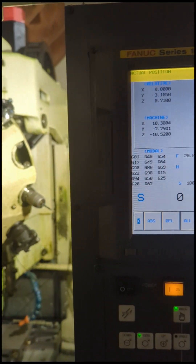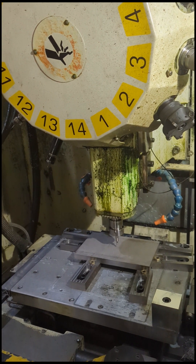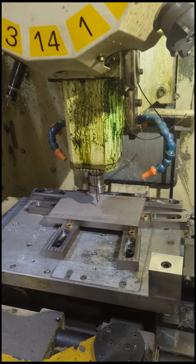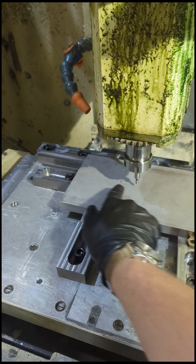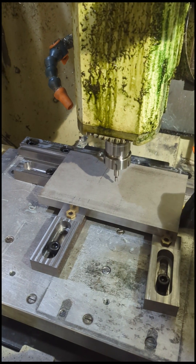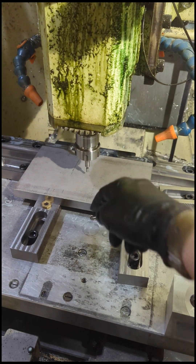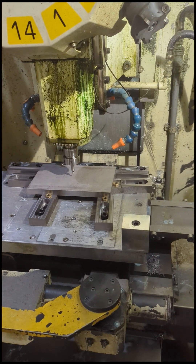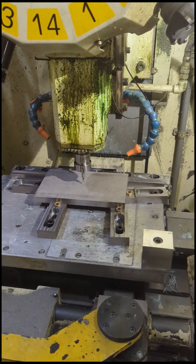I press reset, jog up in Z, and jog until the relative position says zero — it should be right at the middle of the plate. If you're wondering where those numbers came from for both X and Y: because I measured from edge to edge, the length of the plate, you have to add an extra 200 thou because the centerline of the wobbler was offset by 100 thou on either side — same thing with the Y axis. In the next video I'm going to show how to set your Z axis. Now that we have all our tools set up off of the spindle nose, we can use that same spindle nose to set our Z position and all our tools will be set up correctly to work on this workpiece.